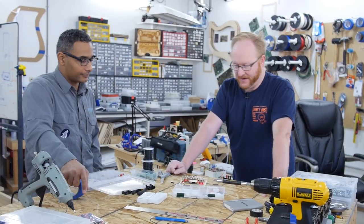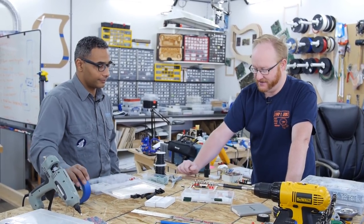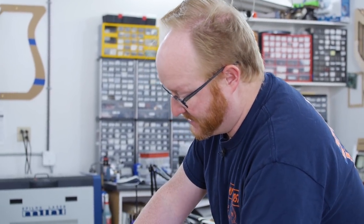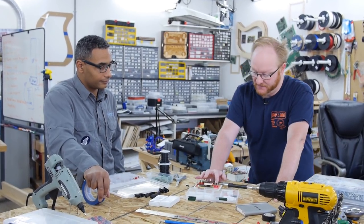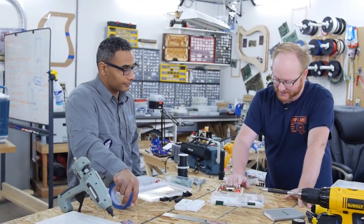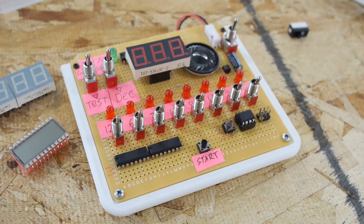What about the LEDs? And the battery? Also the speaker is something we need to think about — we have a bunch of piezos laying around. I think I'd like to have a piezo instead of a speaker because it'd be a little bit more compact. I kind of like the idea of using just these old school five millimeter LEDs. If we made them surface mount, they'd be even physically lower. Right now there's a good distance between the top of the switch and the standard LED, so I kind of like just having big fat ancient LEDs.